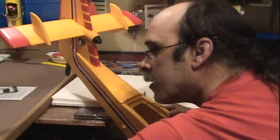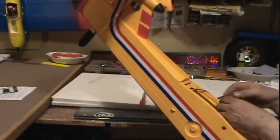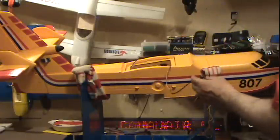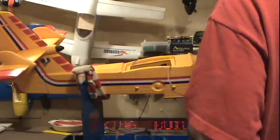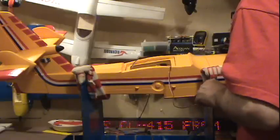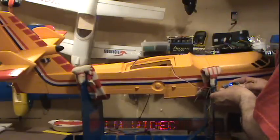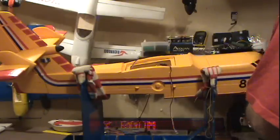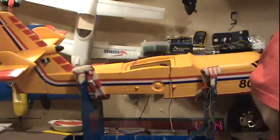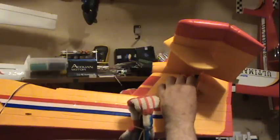I'm going to put a small extension on here to make this a little easier. I'll get the wire, plug it into the battery for power — she's centered. I'll unplug the servo and the battery. My servo is centered, so now I'm going to put the servo horn onto the servo.